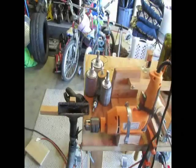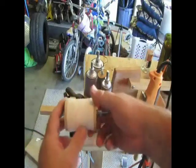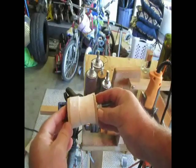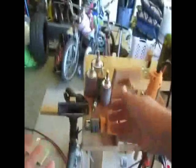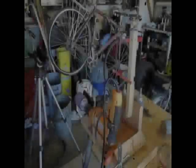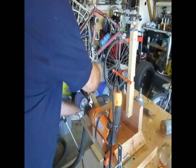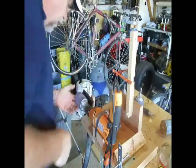The 600 grit is homemade. All I did was take a 2-inch hole saw, then a heavy piece of dense foam, and cut a couple of plugs out. I also cut out of some 1/8-inch stock two end caps using a 1/4-inch bolt. They're squeezed together, and then I coat the back of some 600-grit sandpaper with spray adhesive, wrap it around, and I end up with that polishing drum. The setup uses a variable speed drill with a 1/2-inch chuck to fit the sanding drums. I've also set up a vacuum attachment that snugs right up to the drum to take care of quite a bit of the dust.